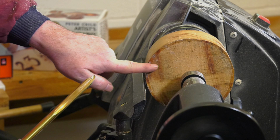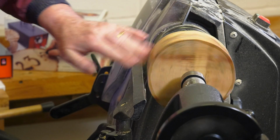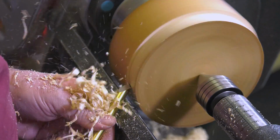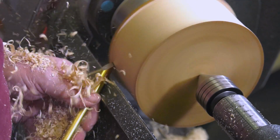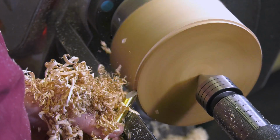As we are working on a pre-cut bowl blank, we are aware that there is end grain and side or long grain, and there are 4 grain direction changes on every rotation of the bowl. To ensure that we get the best possible surface finish on our bowl from our bowl gouge, we must cut the bowl blank from what will be the base, or the right hand side, to where the rim will be, or the left hand side of the bowl blank.